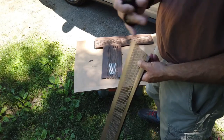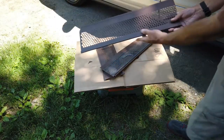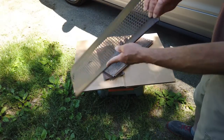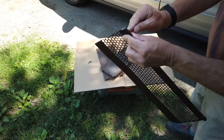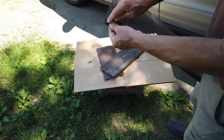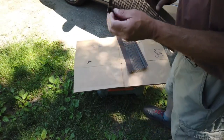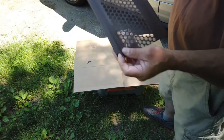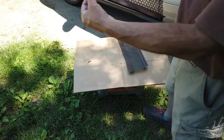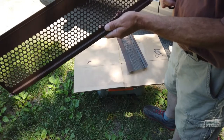EMT shears cut this stuff like magic. The hardest part is cutting through this edge. We have our overall blank for the window — I need to remove this front edge plus the fold down to the plastic. The other side will be about the same removal. I might be able to just trim this rib off so it fits up in the door frame. I've now trimmed these edges back — this outer lip is cut back at my 21 and a quarter, so this edge right here is 21 and a quarter.